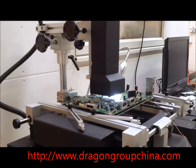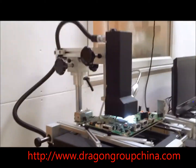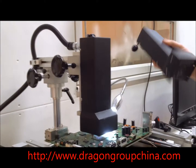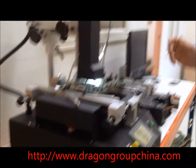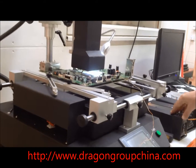What would you say the benefits are with the tube array — mainly heating fast and cooling down quicker? Using the tubes over the standard infrared ones, what I've found is they can respond a lot quicker. They can get hot, and then if they need to cool down fast, they cool down very quickly. They don't hold the heat like the usual ceramics do.